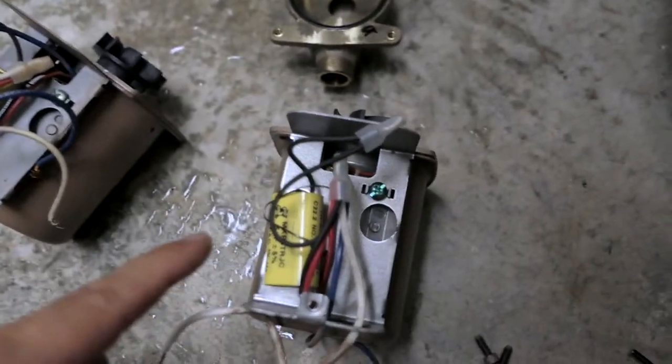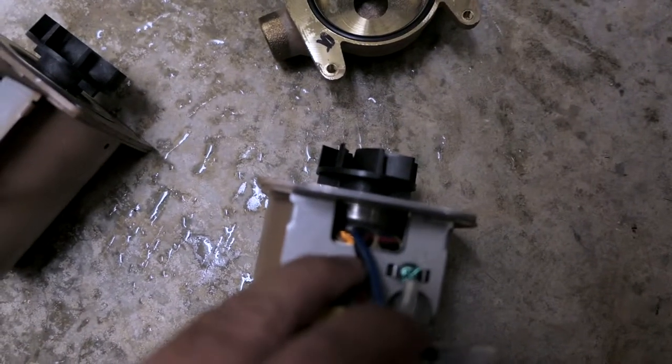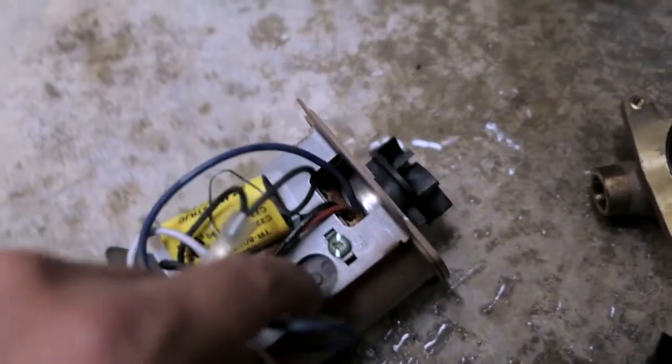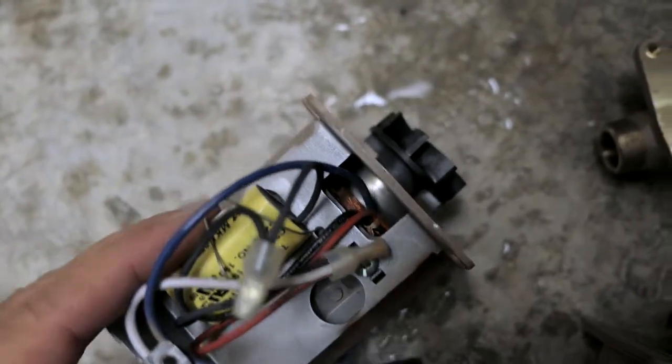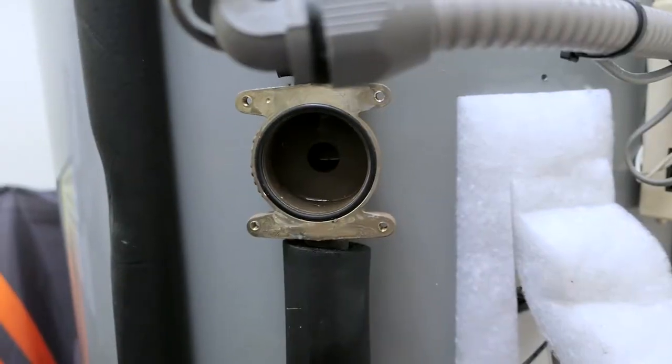The pump is out. I can't really tell anything obviously wrong with it. Here's the new pump — I took the flange off of it and it appears to be exactly the same as the other one. One thing I can tell is the windings on the new one are nice and fresh, but the ones on the old pump look quite burnt and darkened. I'm thinking that winding is maybe shorting out or something to that extent.